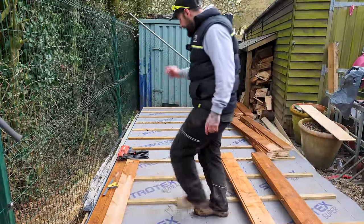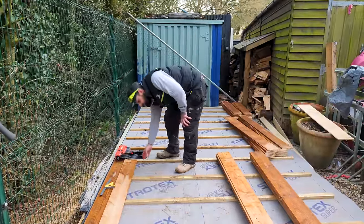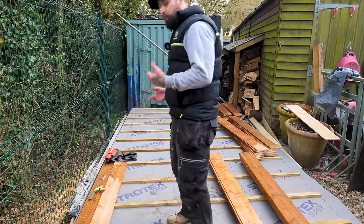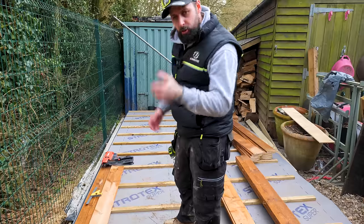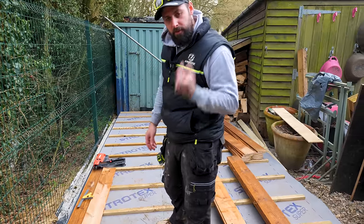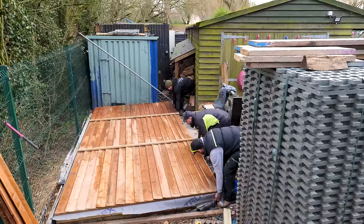Remember, we have landed in the centres of our battens where we need any of our joins to land. And also, we're leaving a 5 to 10mm space between each section, again for some expansion, and we'll show you how we cover that up once we get these on.